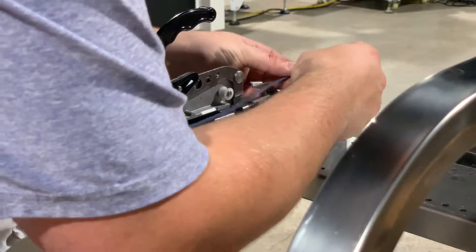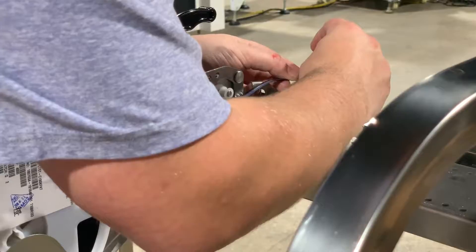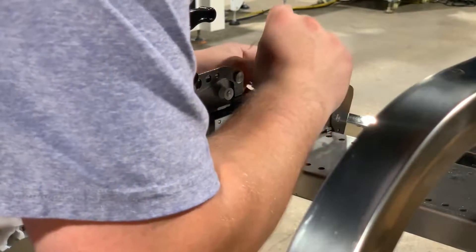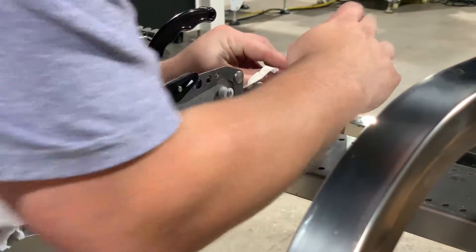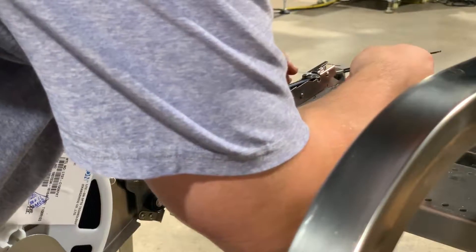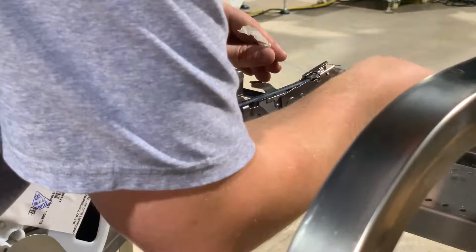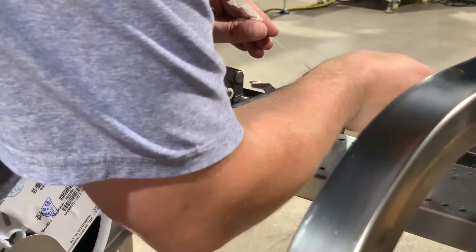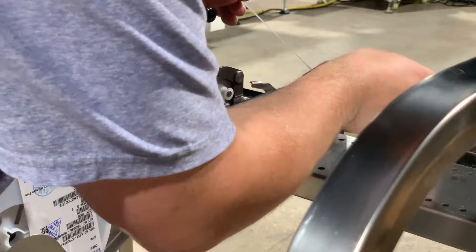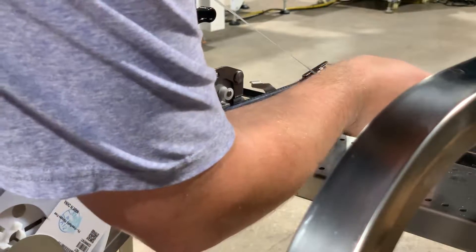That way we have a bit of leeway so we can get our film under this notch. Now we can go ahead and advance our component tape by simultaneously pulling with the tweezers and with the film, and we're going to do that until one of two things happens.